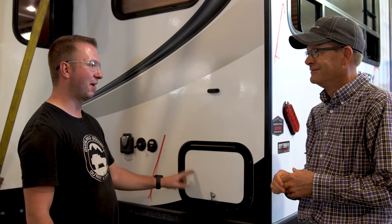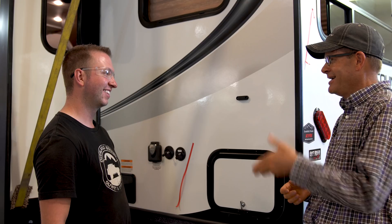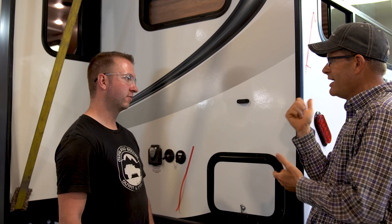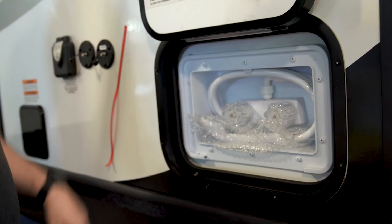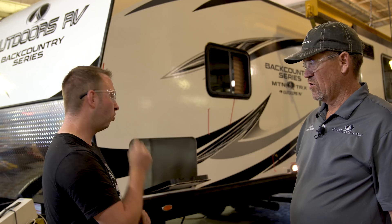I recognize this door. When we looked at better ways to insulate a trailer, everything out there for exterior showers had a quarter-inch thin plastic door. We said there's got to be a better way — so just like we do on our luggage doors with the big one-inch thick doors, we did the same thing here. Now your exterior shower is inset behind the same one-inch thick door, so it's really well protected and won't freeze. There's also a cavity behind that into your living space, so you've added more insulation across your living space and it can pick up on some heat from inside the trailer.